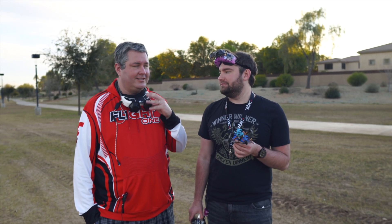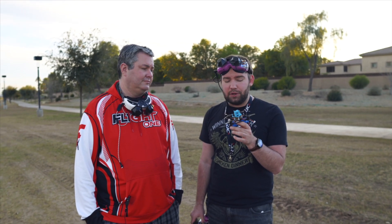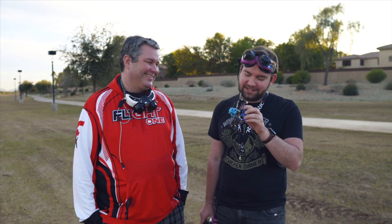The goggle antennas we're using make a huge difference — combined with the better antenna on the quad, it was perfect. We did a long-range test beforehand with the non-HD toothpick using the smaller lighter battery: it was almost two miles out, I had 100% Crossfire RSSI and perfect goggle video, and the only reason I turned around was approaching a highway. It comes with the Pro32 400mW VTX, which is nice, and an 800mW version would fit too for extra range — that would be an easy swap.